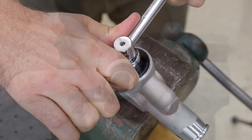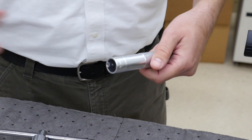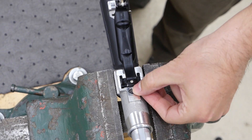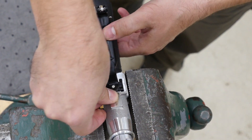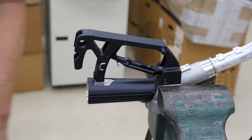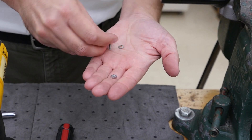Before installing the spout, be sure that you replace the o-rings inside the nozzle body with new lubricated ones. With the nozzle body in the vise, gently push the lubricated spout into the nozzle body until you feel the o-rings seat. Be careful to align the hole in the spout with the hole for the spout pin in the nozzle body. Install the o-ring and the spout pin. Next, install the lever pins on each side, being sure that you install them with the opening facing out. Install the guard assembly and tighten the barrel screw. Put the lock washer on the guard screw and use the square backing nuts to secure the guard.